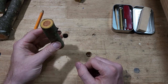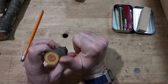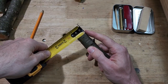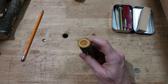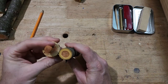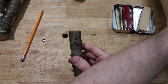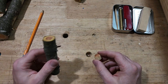This isn't perfect, but it's close enough that I think it'll work. Symmetry in the growth rings is going to make it so that the wood is uniformly dense throughout, at least on opposing sides, which is going to make for a better balanced top. So find yourself a branch. This one is a little bigger around than my thumb — about an inch in diameter. That's a pretty good size to start with. Doing something really big like this guy, which is more like an inch and a half, is harder to do. It just takes a lot more cuts. Start with something that's about an inch because it's pretty easy to make a pretty good top out of that.